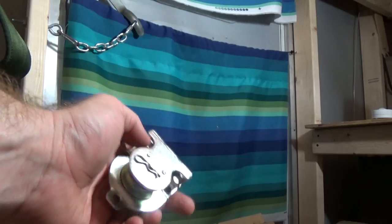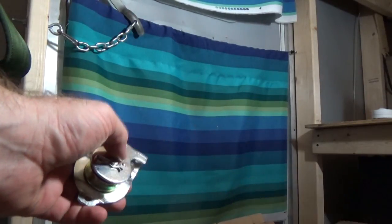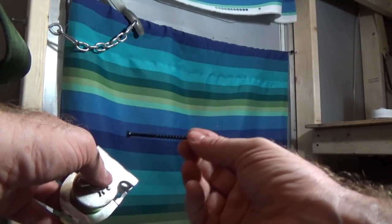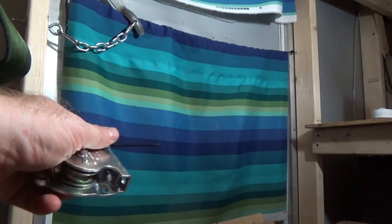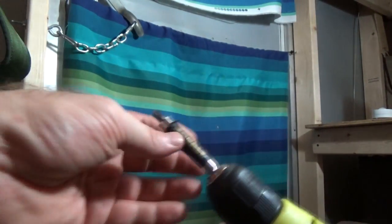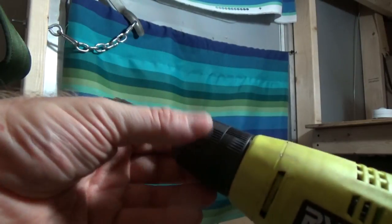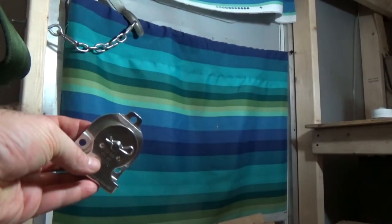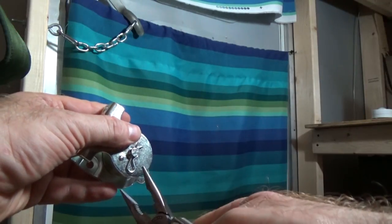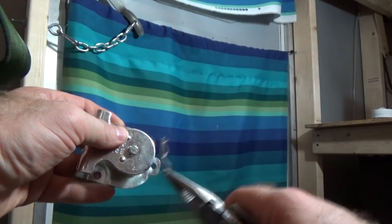Before you get started you'll need: a pair of needle-nose pliers (I have a Leatherman), a pen to mark how far in your pulley needs to go, three-inch deck screws or drywall screws, a drill bit to pilot the holes, and a DeWalt drill with the outer grip that spins while guiding — it's going to be tight quarters. To remove the spinner on the pulley, put one side of the needle-nose against the edge of the outer rim, grab the inside of the cotter pin, and squeeze — that'll pull it right out. Keep these in a safe place.